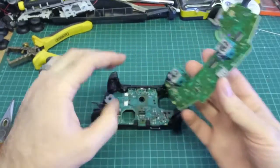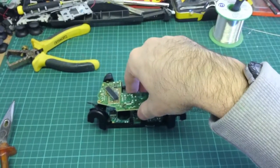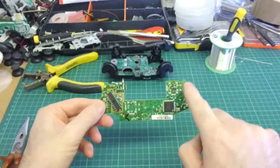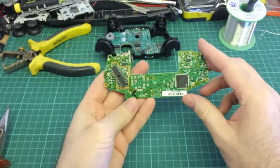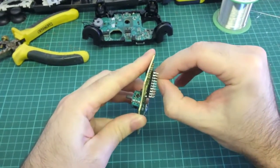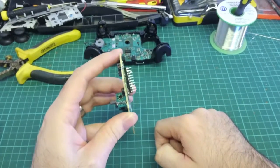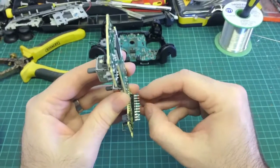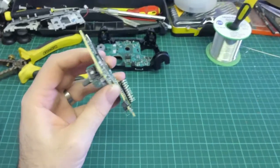This is the one we're going to be working with. You can see there are two sockets that match the two plug sockets, and that's what plugs into this board. With your chip now glued in place, prep your chip by bending the trigger connection pins together — looking at the wiring diagram, the trigger connections take two pins, so bend those two pins together. That makes it a lot easier to connect one wire to them. It's pin three and four from the bottom on each side.